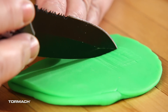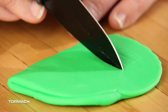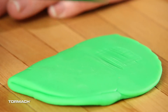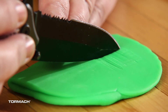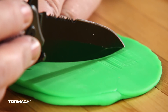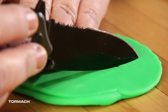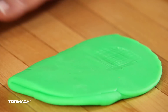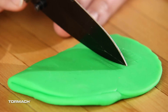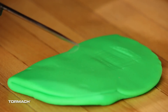Obviously I'm using modeling compound here, so I'm not going to get a mirror finish on it, but it gives you an idea of the technique. When you're polishing materials — especially aluminum, which is really soft — you can actually feel the give as you're polishing; you can feel you're pushing the material around. The point is you want it to be able to spring back, because you don't want to change the structure of the material and you don't want to introduce heat. You're creating a real nice uniform finish, and you're going to be doing that with your stones, your paper, and finally your diamond.